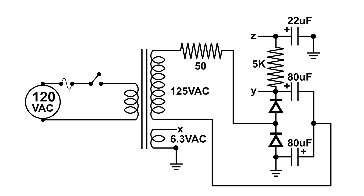You can see that we've got a power transformer there, and we don't get much increase in voltage on the secondary side — 125 volts, with 6.3 volts for the tube filaments. This is also an isolation transformer besides being a power transformer.